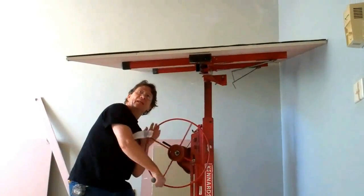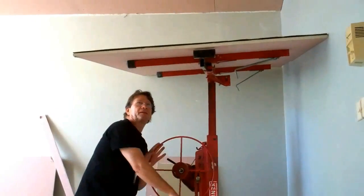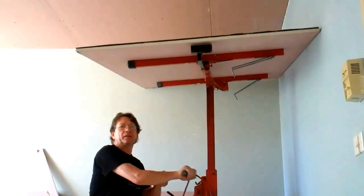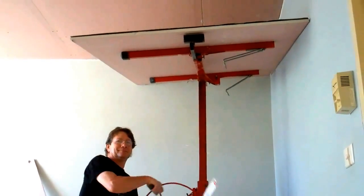Now we lift the second panel with the viscoelastic membrane on it using a panel lift — it's much easier and much quicker. The ceiling is now finished with joins sanded and ready to be painted. This is not the cheapest way to do it, but it's certainly the most efficient and cost-effective way. Feel free to give me a call any time or send me an email — I'm always very happy to help.